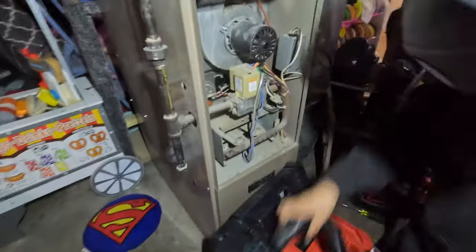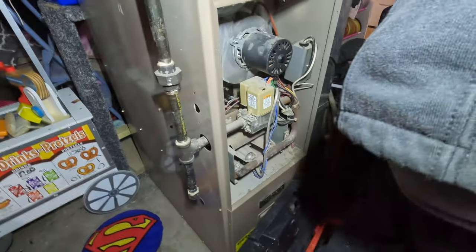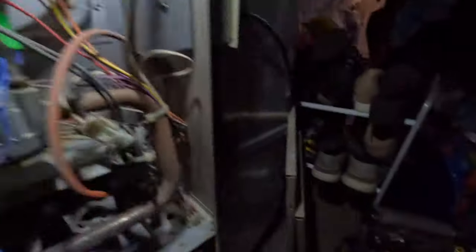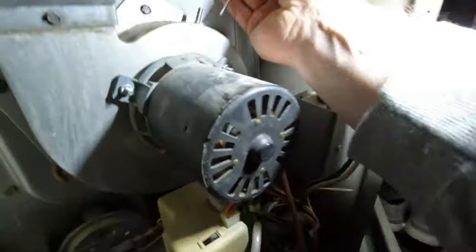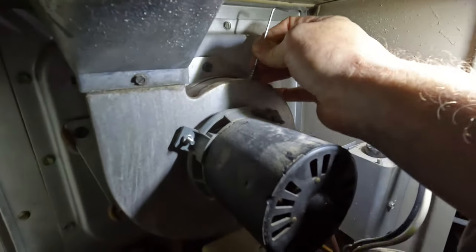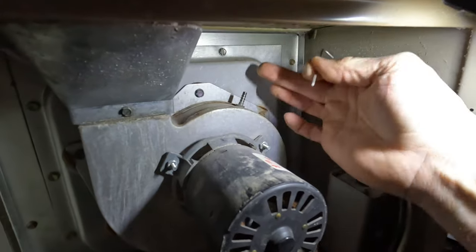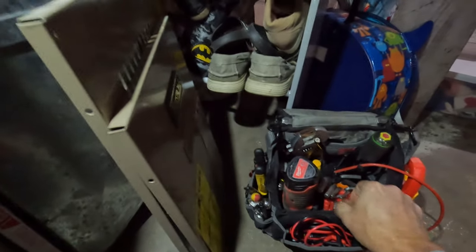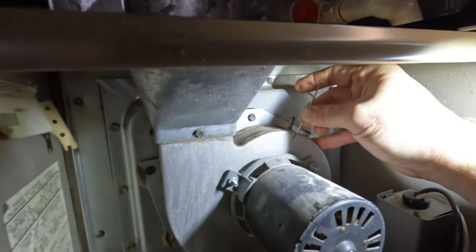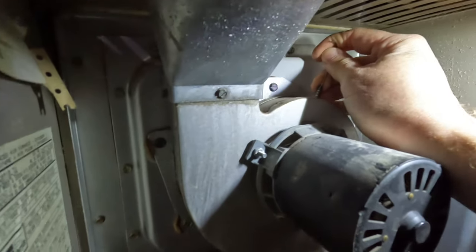Switched it back wrong. Yeah, it's dusty. So we're sweeping this off and I'm testing. I ran a 1/4-inch Allen wrench down this pressure switch port and it stops — it doesn't go any further. It should go all the way in, so I'm gonna have Tyler grab me some drill bits. I'm gonna see if I can run a drill bit down through and drill that out, because it's probably just full of gunk that shouldn't belong in there. This furnace obviously hasn't been very well maintained. So it's stopping right there — it's definitely plugged up, because that should go all the way through.